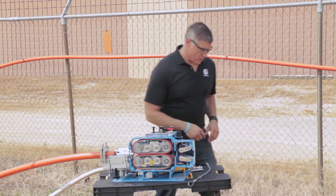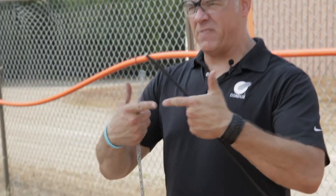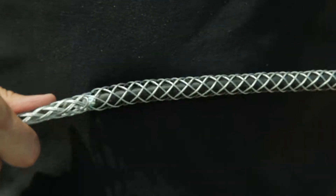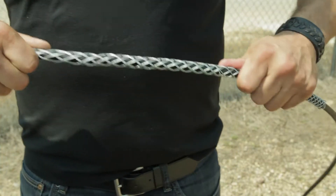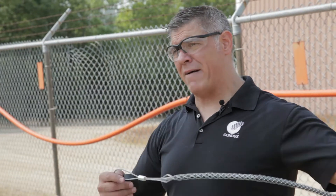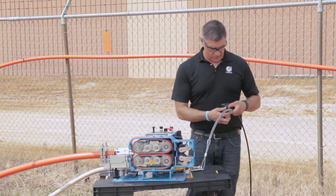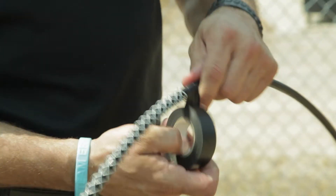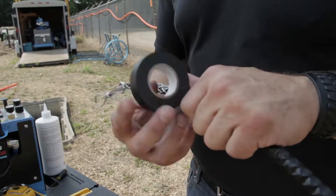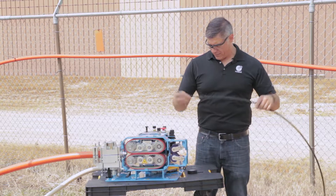When we prep the fiber, we need to add a grip — this acts basically like a Chinese finger trap. You're going to squeeze the end of the basket back, slide the fiber in, and work it on. This is a very nice way to put a birdie or carrier on the end to blow it in. The problem is if you hit an obstruction and need to back it out, if it's not taped it'll slide right off. So we always tape it very well, starting at the bottom and working up to the top. This also covers any rubbing the grip may cause on the duct, going all the way to the top so the basket is securely fastened to the cable.